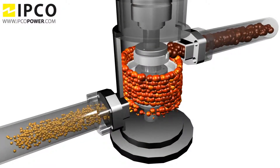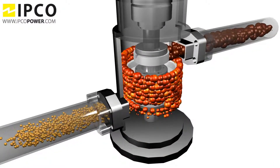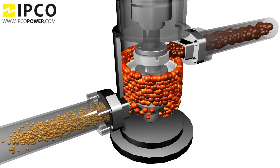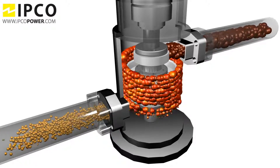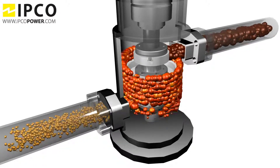The main technology used in the water fuel emulsion system is a homogenizer. The homogenizer is a rotor spinning at 3000 RPM to create a shearing force, to reduce the fuel droplet size from 70 to 3 microns.